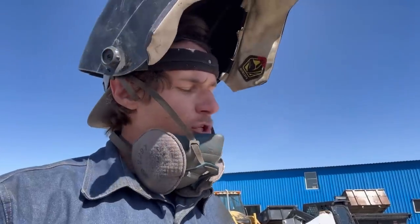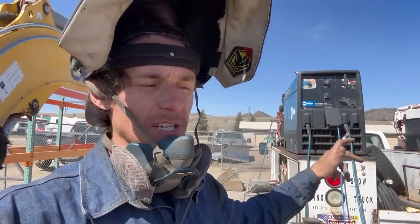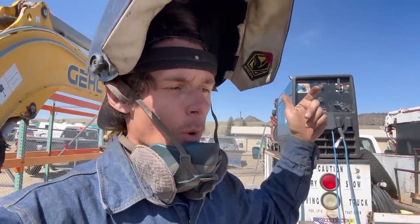Okay, we're going to be comparing it to Matheson's 5/32 carbon arc gouging rod. And the reason I'm using the 5/32 is because it has a comparable amperage range to the 1/8 inch Electra rod from Rockmount. So let's put this head to head, see who wins. With carbon arc gouging, you can run it in DCEP, DCEN, and AC. I'm gonna switch my machine over to DCEP because that's how I'm used to using my carbon arc rods, and I wanna keep it in a similar atmosphere. We might switch it over to DCEN just to see what it does.